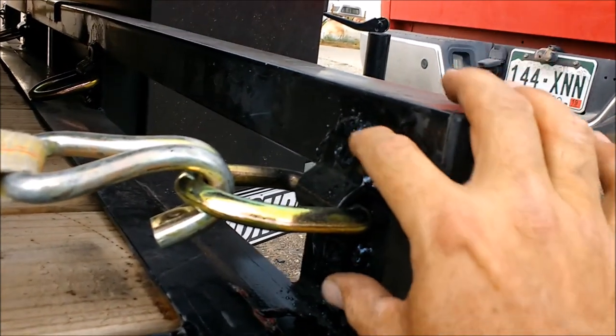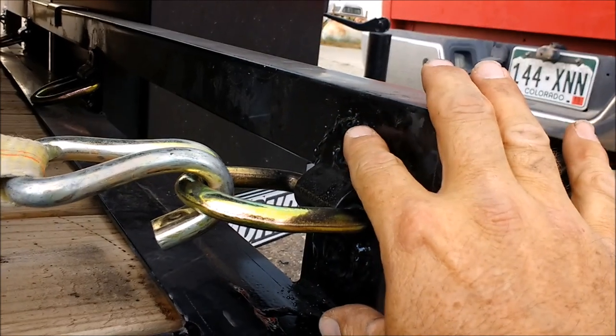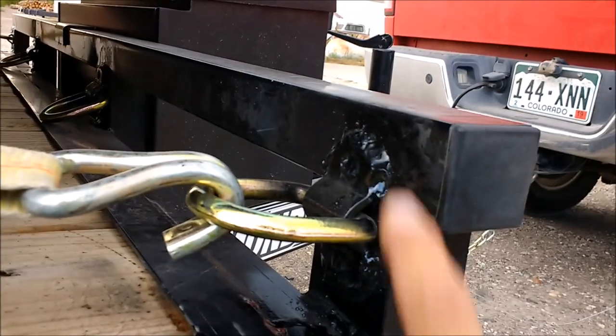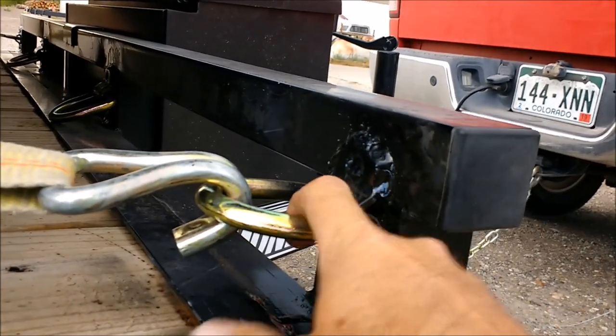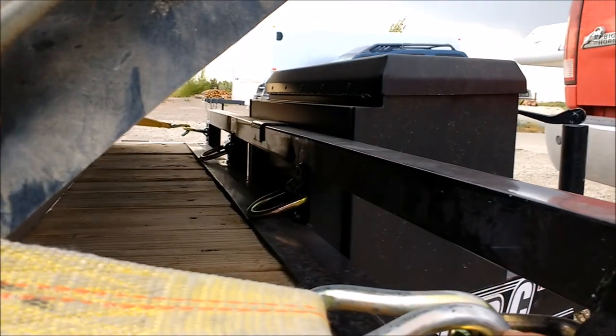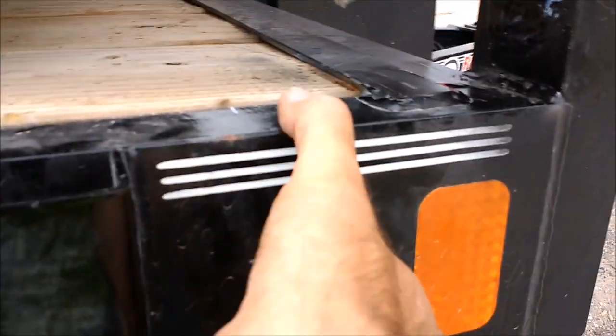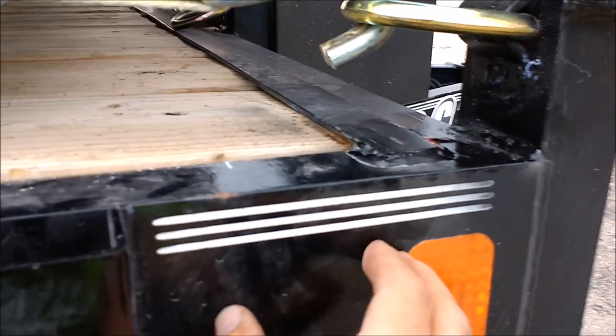When I moved it up here and welded across, I burned through because this is thinner tube than the angle iron right here. I burned through a couple times and had to patch holes, so I figured it wouldn't be as strong as having it lower. The subsequent ones I welded a bit lower — just something to keep in mind. These are C-channel sides, so they're pretty strong; the D-rings on the side probably would have been fine welded on.